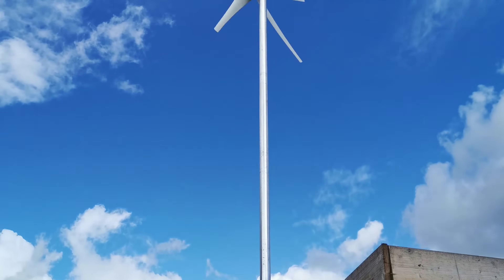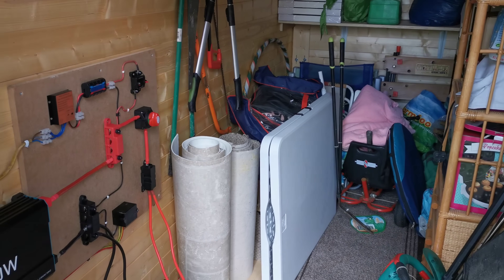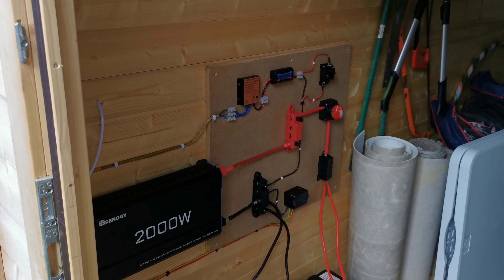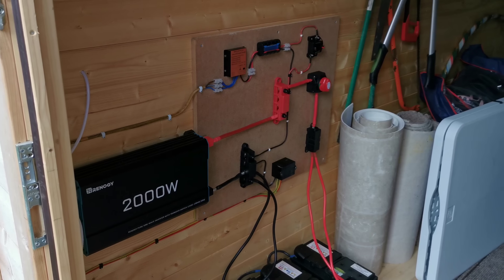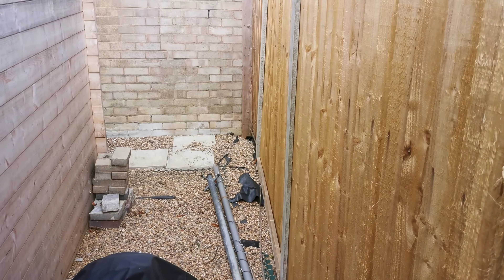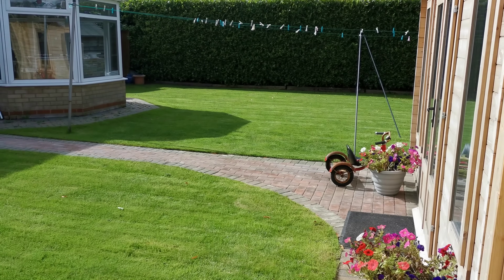The interesting bit I hope for you guys — I was very short on how people wired it into their system. What I'm going to show you is not perfect, it's my first attempt. I took a lead from all you good folk out there and avoided some of the pitfalls. Before I go in and show you this bit of a control board, one of my top tips is: earth your system. Down there, poking out the ground, is the top of a five foot earth spike that I drove into the ground to earth the system.